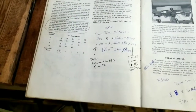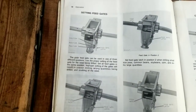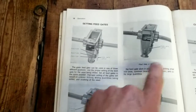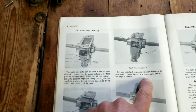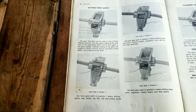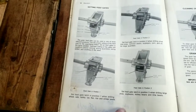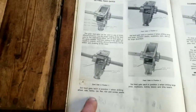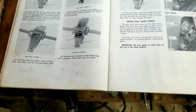I don't know how accurate you want to be, but that's the method I used and it's explained in the manual too. The manual also covers the feed gate: position two is for drilling small-size peas, common beans, soybeans, corn, and extra-large quantities. Position three is for large peas, soybeans, and kidney beans. I set it on position one for oats and position two for soybeans.